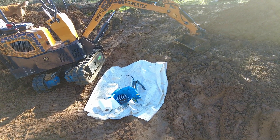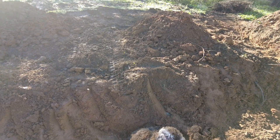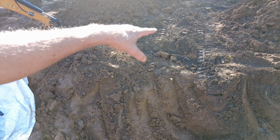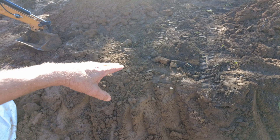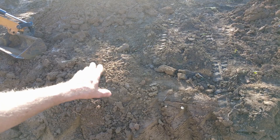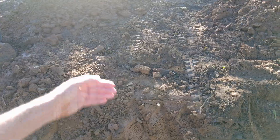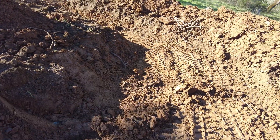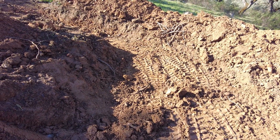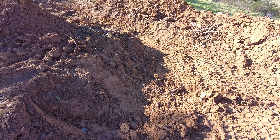The next step is to get this excavator out here once again and then remove this subsoil. I've already removed the topsoil. Now under the topsoil — the subsoil — I want to take out another 10 centimeters. Then we can bring all of that into the keyway and start building it up more and more. I've done about 20 centimeters already. Still a long way to go.